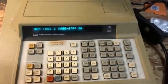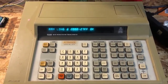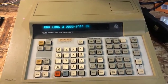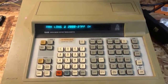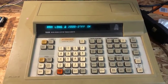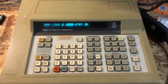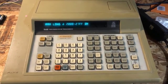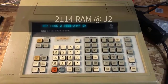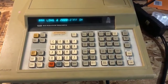When I put it in my actual Battlezone cabinet, it came up with a long high beep and then a low beep. The manual said it should give a high beep for the first bad ROM and a low beep means it's a good ROM, which confused me because it gave the low beep after the high beep. The manual said that would be J2, assuming the first high beep means the first one was bad.